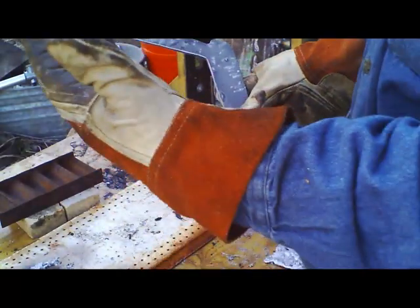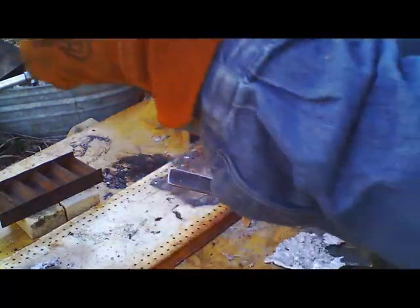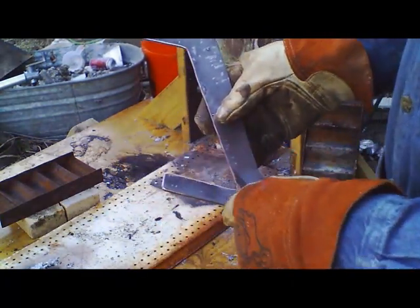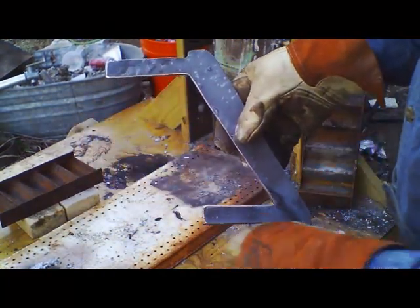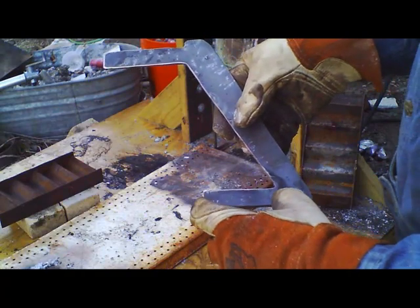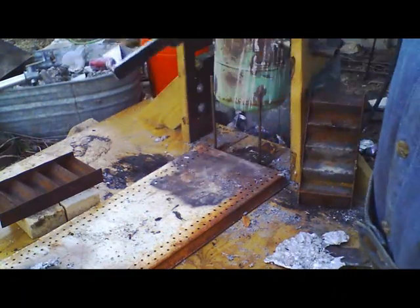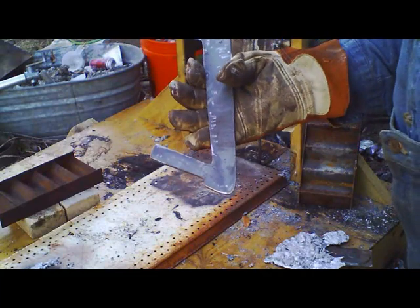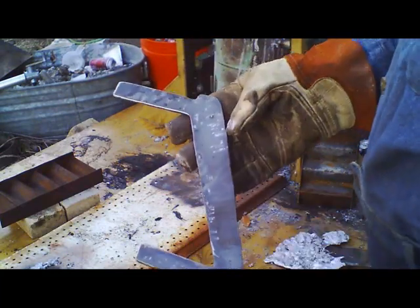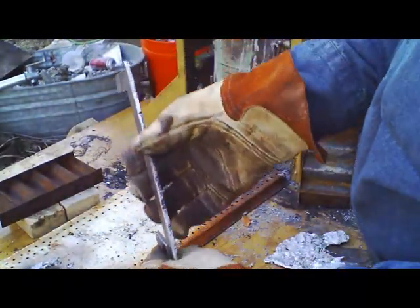This is something you've got to make after the furnace is done. What I did was I took a piece of cereal box, stuck it on one side of the two handles, took a pencil and traced it out. That gave me the OD of both arms, then made this eleven-sixteenths and about three inches long, and it works perfect — it locks the handle in. Once you've got it locked in, you can grab this and lift your furnace with it — it's that solid. I made it out of three-sixteenths, or seven-gauge steel.